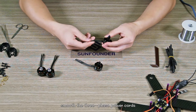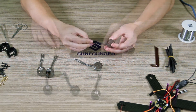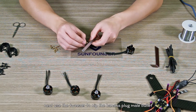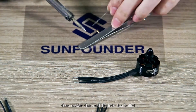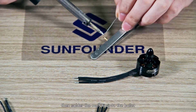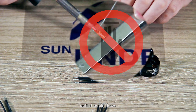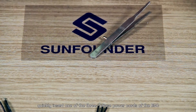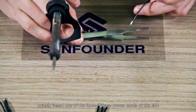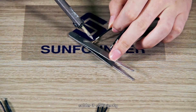Smooth the three-phase power cords. Next, use the tweezer to nip the banana plug male bullet. Then solder the melt tin into the bullet. Pay attention not to touch the bullet or the tweezer part until it cools down. It may take about 2 minutes. Quickly insert one of the three-phase power cords of the electronic speed controller into the bullet.